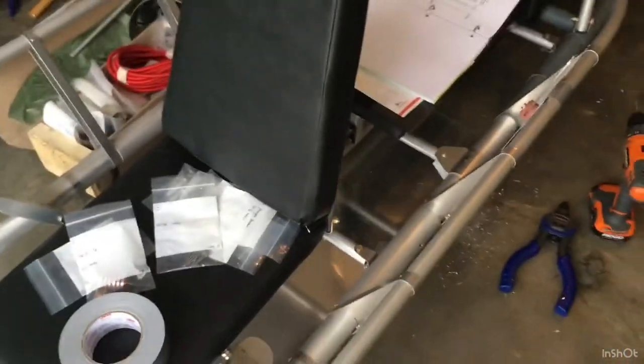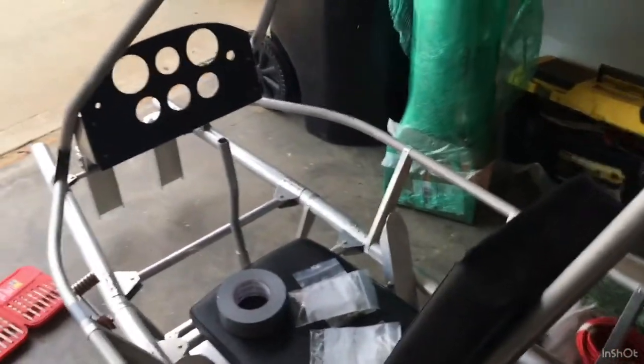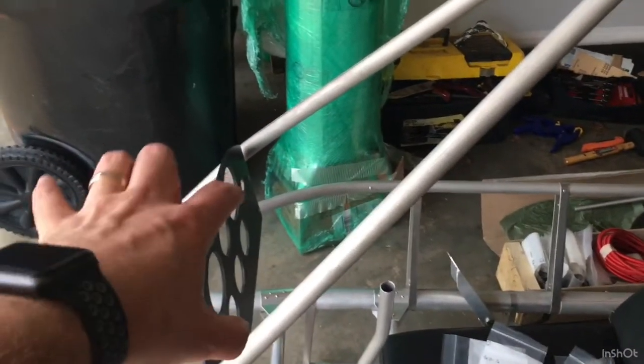My instrument panel's mounted. I'm just picking this apart little by little. I might try to get the gears done — I don't have my wheels yet but brakes, rims, and tires are coming in a separate kit. I can install the nose gear and get the main gear together just so it's sitting off the ground. I'll also pre-wire the instruments so when the motor comes I can wire everything up. There are 26 groups, and as Tom says, you do your best work on what you're in the mood to do.